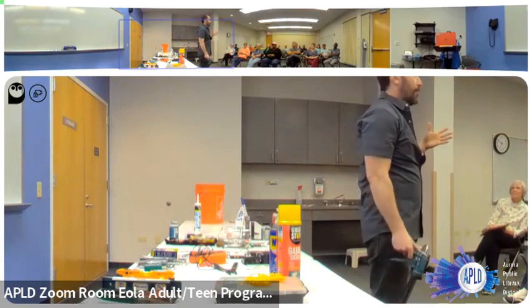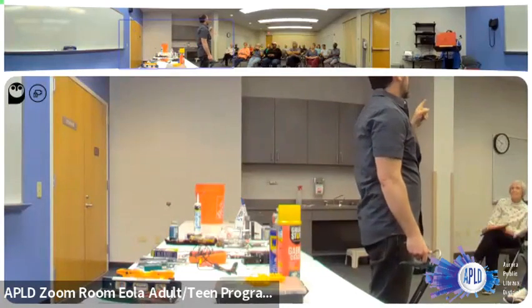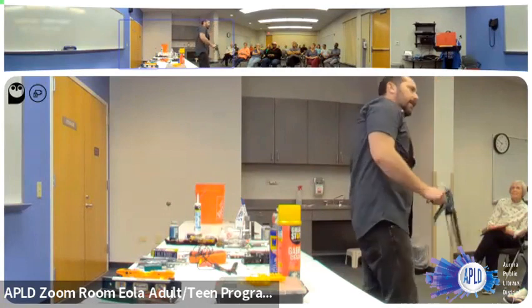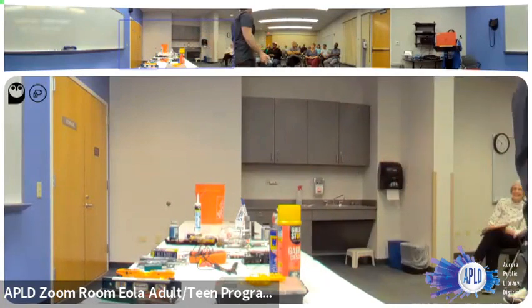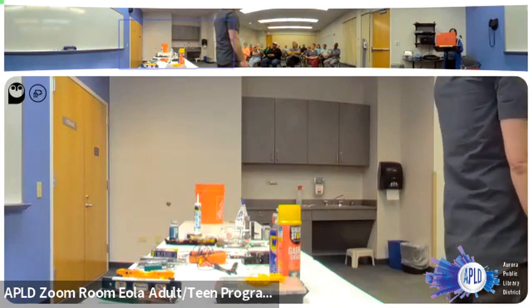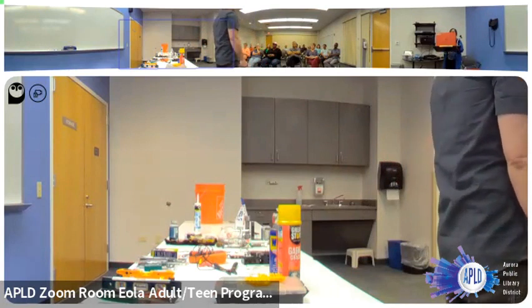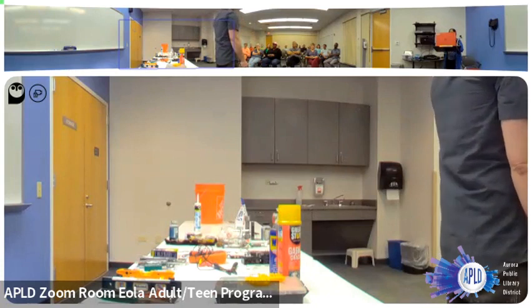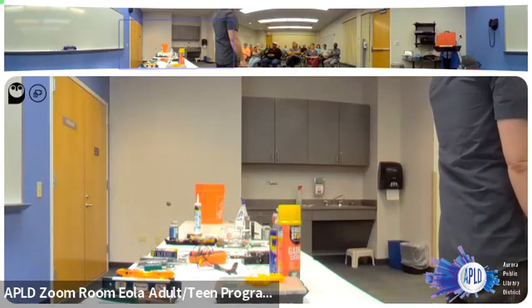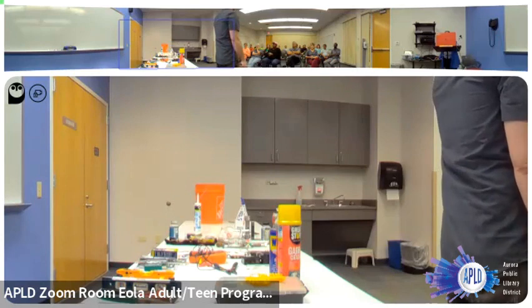If you don't know what you're after, if you go to the store, there's a whole aisle of caulk. As far as I'm concerned, there are two caulks, silicone and latex, and that's it. The only question you have to ask yourself is, is the thing I'm trying to seal wet? If it's wet, or if it's going to get wet, or if you want to keep water from getting in whatever it is you're sealing, silicone.